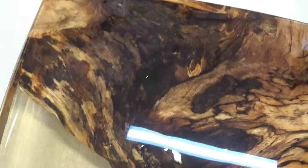When all the air is out and we don't see any more bubbles, we'll take the vacuum off and the cactus juice will be allowed to soak into the wood. It'll be drawn in to fill all those open pores where the moisture was. Then we'll bake it in the oven and that's going to set it up just about like epoxy. It doesn't fill big cracks, but it does stabilize the wood and make it hard.